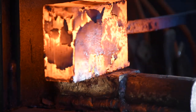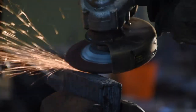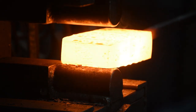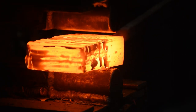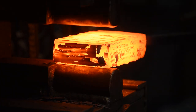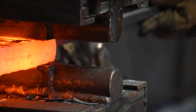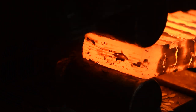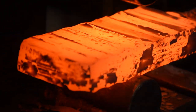You'll see there's a little weirdness in the edge there due to the layers being slightly different widths, so I'm going to grind that off before going back into the heat and stretching this thing way out. We'll be pulling this out to about three times its length. I've dropped all the sound out here because the sound of a sped-up press sounds absolutely terrible. But watch this thing get so much longer — it's really neat to do. You want to go fast, but you don't want to go too aggressive and overwarp the pattern. The changes to the pattern come in part from how the steel gets moved slightly different in slightly different places, so it's all right.